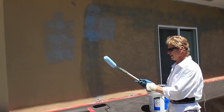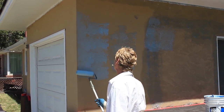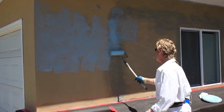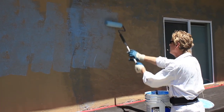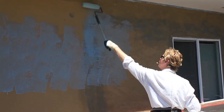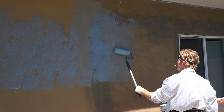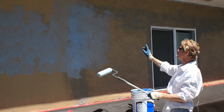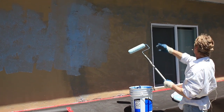Ghosting means my new work will have one color and the surrounding area will have another. So because this has been painted 10 or 15 times, all you have to do is roll the bonding agent on one time — it doesn't have to be thick. Now here I'm going heavy because I have to get the suction correct. If the suction isn't correct it's going to bleed through. If you don't understand 'ghost' or 'bleeding,' you'll just see the patchwork — you won't see the texture difference, but you'll see a color difference.